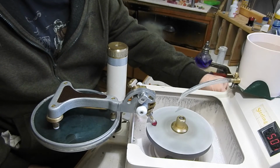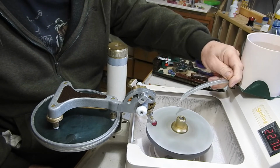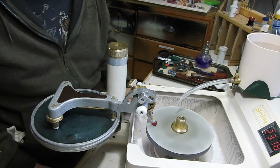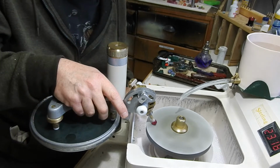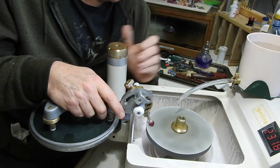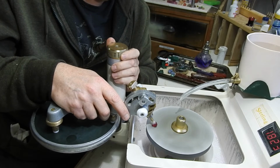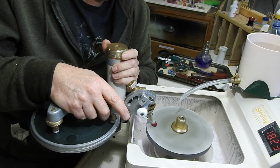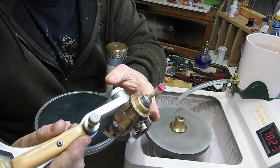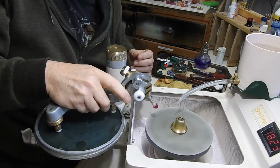Power, water, and this is going to get noisy, so I'll just start the first one and then I'll come back to you when the first lot's done, because I'm using a harsh 240 disc to eat away a lot of the stone. Been a couple of minutes. You can see how this very harsh diamond disc is chewing through that ruby.